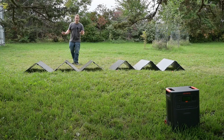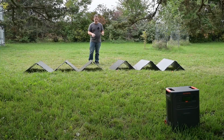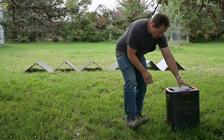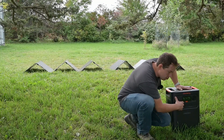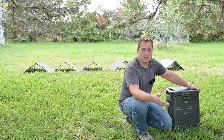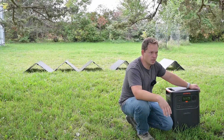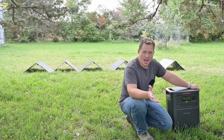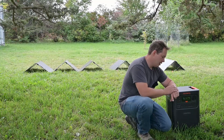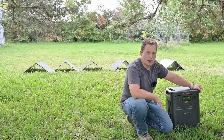Today's a little bit overcast but we have our two 500-watt Solar Saga panels laid out here feeding into the Home Power 3600 Plus. On the display right now we are bringing in a total of about 200 watts. Earlier we were bringing in closer to 300, and as the sun comes in and out of the clouds we could in theory see up to 500 watts from each panel in ideal conditions. We'll leave this out here and track the output in the app — it's about 11 a.m. and we'll give this several hours.